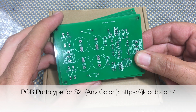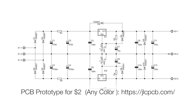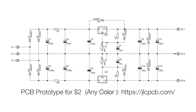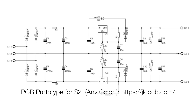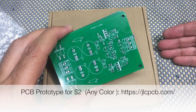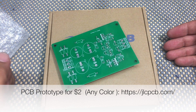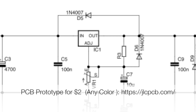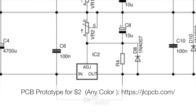I wanted to build a power supply for a preamp. It needed to be a dual supply, very well filtered, well regulated. This is the sort of supply that I very often need and have to repeat doing, and every time I do it I promise that I'm going to build a board professionally so the next time I don't have to go through the same pain — and I never do that. This time I decided to do that. Taking the standard adjustable voltage regulator supply using a LM317 for the positive supply and LM337 for the negative supply, what you get is a very, very easily modified circuit.